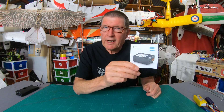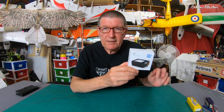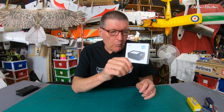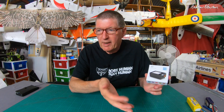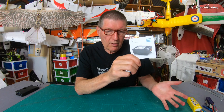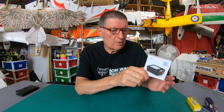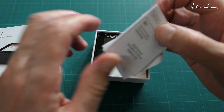It's also an ESC tester and a variable power supply, which is very useful for hot wire cutting. At the moment I tend to plug in either a 4S or 2S battery depending on how long the wire is, and I need to keep the current going through the wire to about 5 amps. So it's a very useful little piece of kit for on the bench or taking to the flying field.